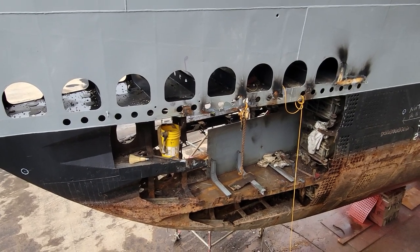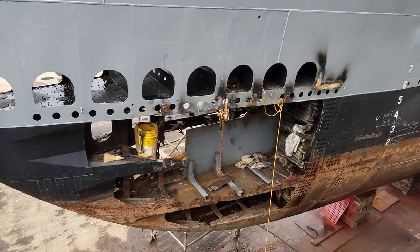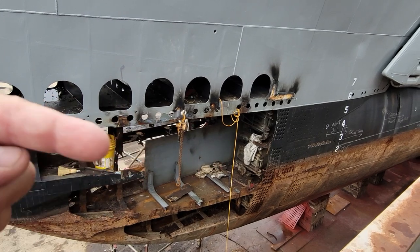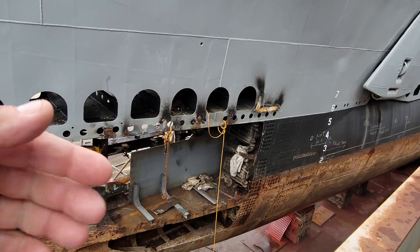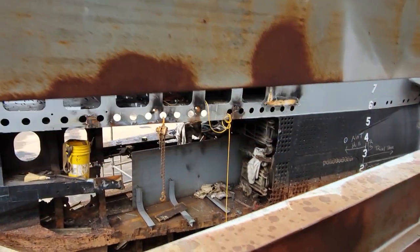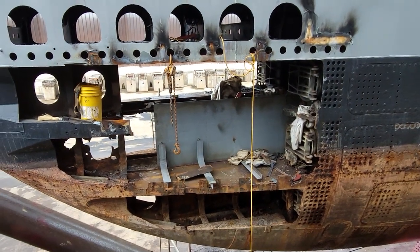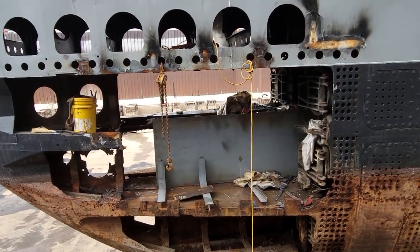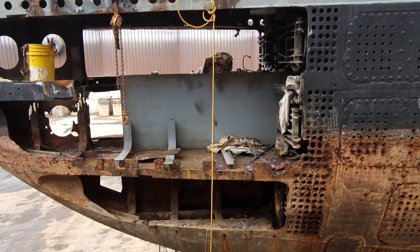Here's a view of the forward torpedo area. It was heavily corroded between the top torpedo and the second torpedo — really bad — because this is your waterline area. Wherever it gets wet and dry, that tends to be your worst corrosion, where the area below is nowhere near as bad. Ohio and Pennsylvania have been doused with rain for the last few weeks, a very abnormal July, so I'm going to try to do this without getting too wet.